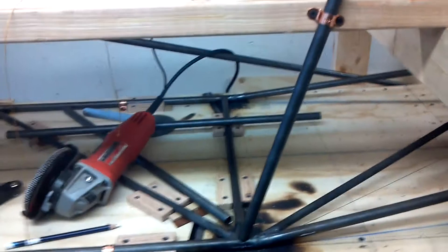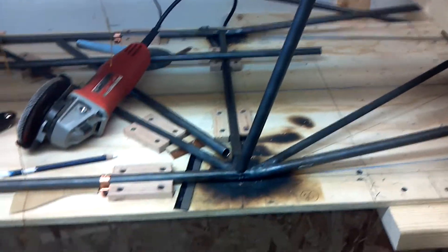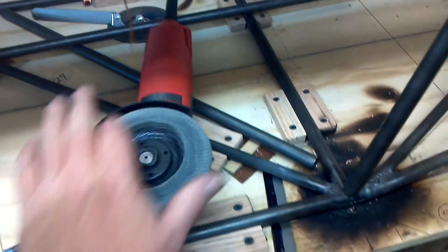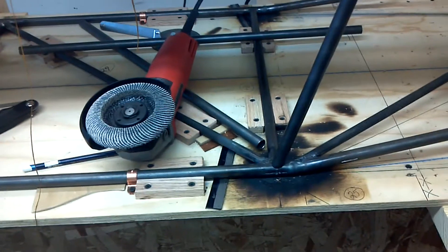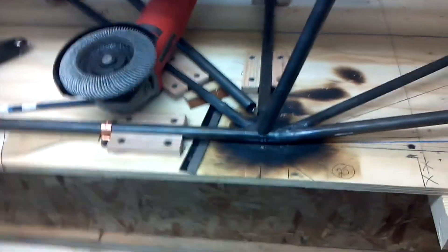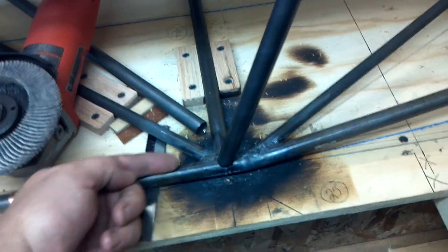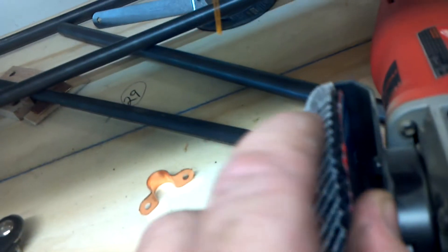This is my first piece going in for my side. This whole joint was coped using a disc sander — first I find my angle, throw it on the disc sander and make it flat. Then I hold it up, put a nice little radius on it, fit it down, and put a radius on both ends using this radius edge. Works really well.